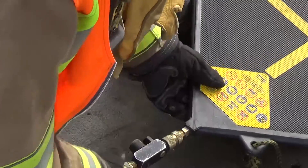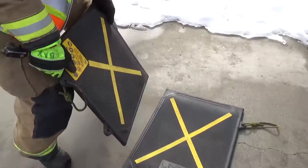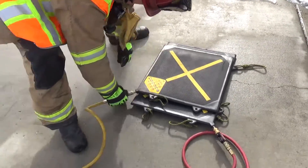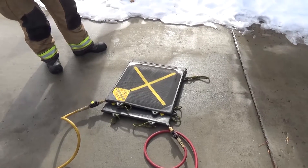All the weights and heights are listed on the bags — select the proper bags for your operation as needed. Offset your dead man or air hose valves to either side of the lifting operation to ensure a clean setup. Line up the X's — good to go.